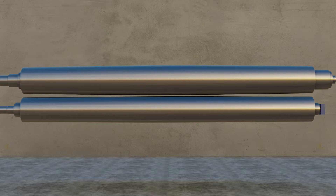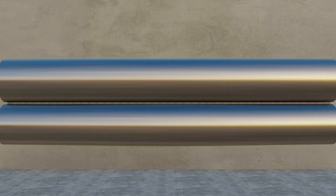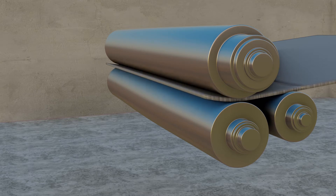How much the rolls deflect depends on where you are working within the capacity of the machine. The rolls are generally cambered for 50% of the capacity of the machine. When rolling a part at around 50% of the capacity, the camber on the rolls is deflected so that the part is pinched evenly across its entire width. In this condition you will get a straight edge during the bending process.